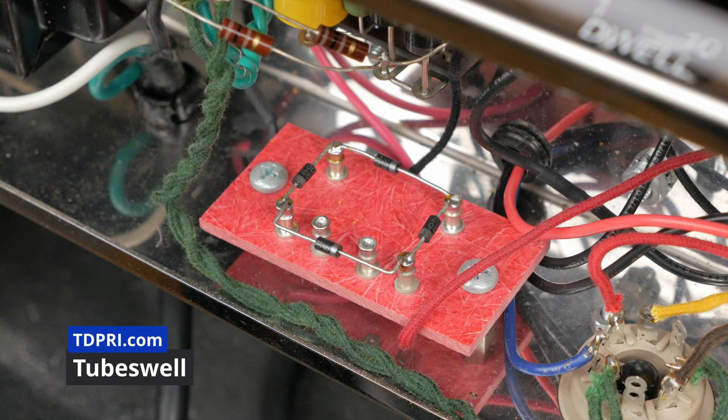Lastly, I played around with a ton of different reverb tanks. Make sure you select one with the correct impedance. For the standard 6G15, that'll be an 8 ohm in, 2250 ohm out tank. You have the choice to mount horizontally or vertically. Make sure you mount the tank the way it was designed to be mounted.